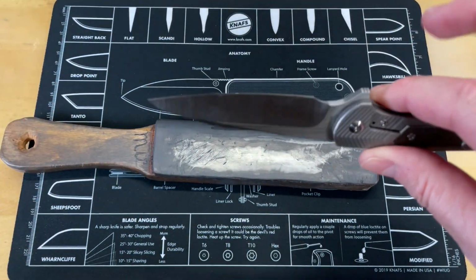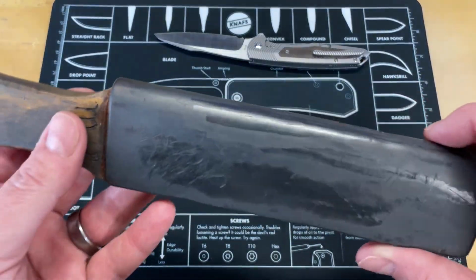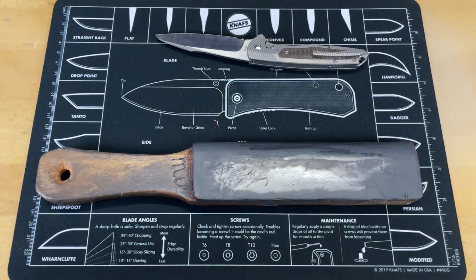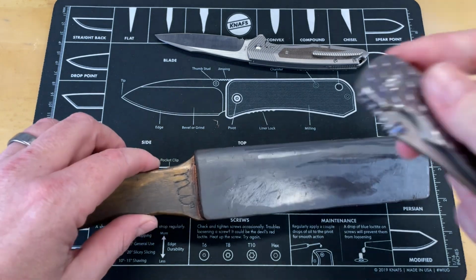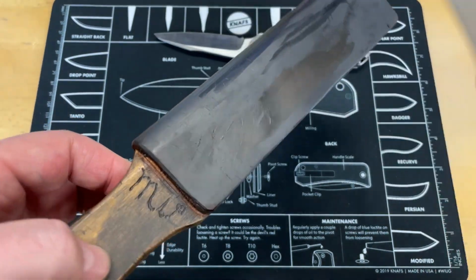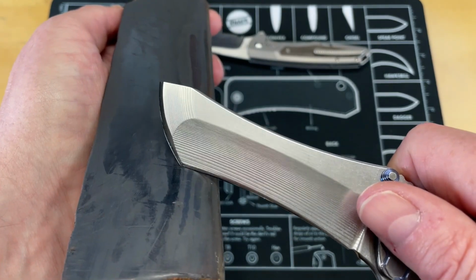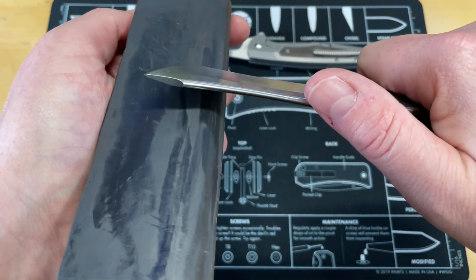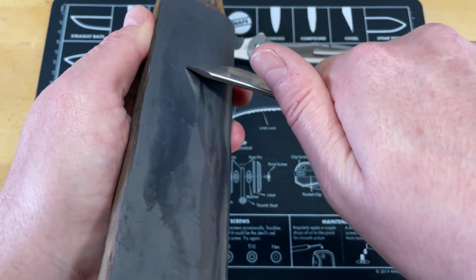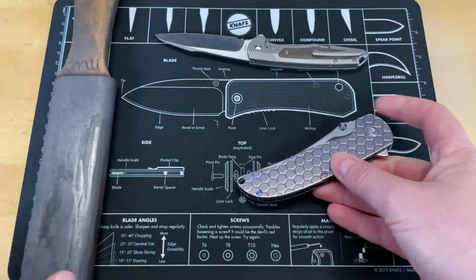The thing is, if a strop and a hone don't work, you are going to have to go back to your sharpening stones. The nice thing about one of these paddle strops, this was made by one of my subscribers, Marla White. She sent it to me. See this curvature here? That comes in really handy on some knives, like a recurve Tonto, like my Norseman. Because to use this part of the strop, you see, just like with sharpening, you wind up with that gap. That's not what you want. If you have got one of these, you can actually strop up your recurve knives just simply by passing it a couple times this way and a couple times the other way with almost no pressure. And then you can do this nice forward leading edge, and then you've stropped your edge up and you've maintained it, and you should not have to sharpen as often.